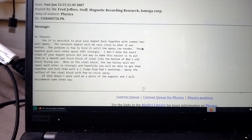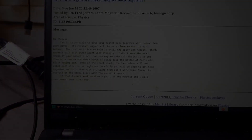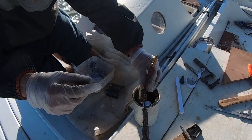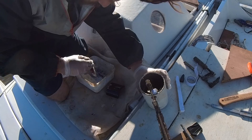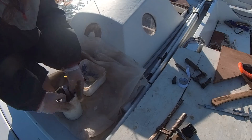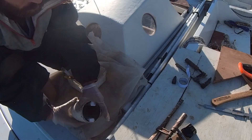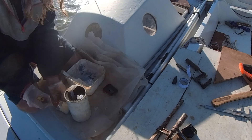Spray the steel block surface with non-stick spray. There is a gap between the magnets on each side that is also where the bolts go through. I figured I could jam two pieces of wood wrapped in plastic in there so the glue wouldn't stick to them. There isn't much clearance around the rotor — about one millimeter — so this needed to be pretty accurate.